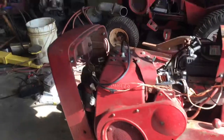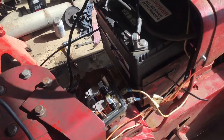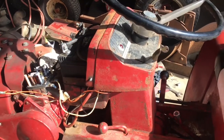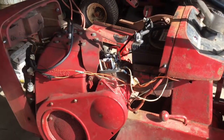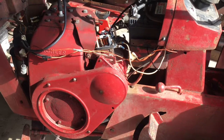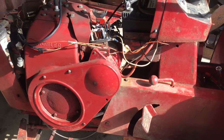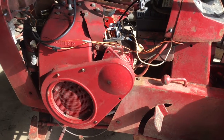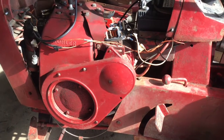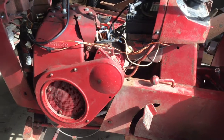The engine oil is good, but I just realized that it's not charging. While it's running, that generator light is on and that light is supposed to go out. I only have like 12.8 volts at the battery while it's running. I'm trying to get through the regulator manual and understand what's going on, but my meter is not helping. I do have a couple other starter generator engines that run — I might just swap out the whole starter generator with a regulator on top and hope for the best.